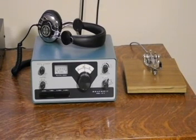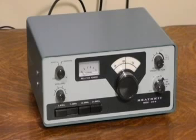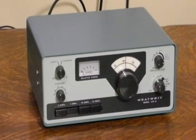An active audio filter offers selectivity of 750 Hz in the wide setting and 375 Hz when set to narrow. Sensitivity is rated at 0.2 microvolts. Tuning has a vernier dial. No speaker is provided — it drives headphones. It can transmit in CW mode only, and power varies from 3.5 to 2 watts depending on the band. The transmitter is VFO controlled. There's a transmit side tone with adjustable volume. While not true break-in, Heathkit called it semi-break-in — there are no switches to throw to switch to transmit, just keying.